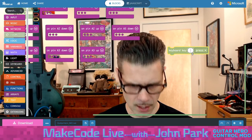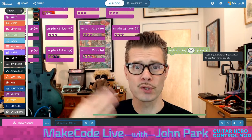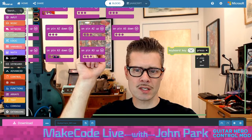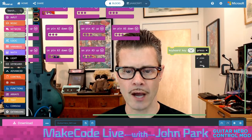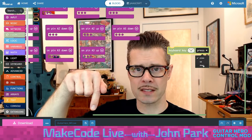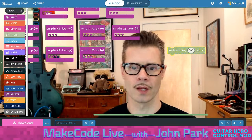The 'down' command holds the key and gives you a repeat in some applications — like in a word processor, as long as it's held it will do the key repeat of your operating system. Then 'up' is the upstroke that releases it. There are keyboard modifiers — anything that needs another key added to it, such as shift, control, command, or the Windows/meta key. So if you needed shift-A to mean something different from A, you can bring in a shift being pressed down followed by the A being pressed down. That's how you get capital letters as well as any command key combinations.